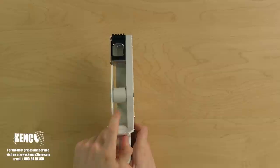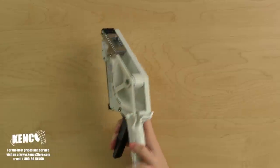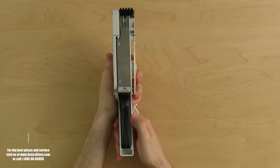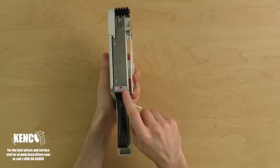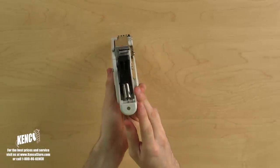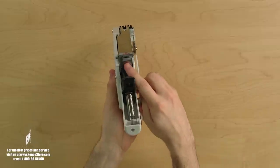On the label shaft, you will see a plastic core. I'll be talking more about this plastic core later on. Rotate the applicator and take a look at the bottom. Here, you will see the feed mechanism door and a hinged latch at the bottom. This latch has a set of teeth to help tear the liner and a lift that helps bend the liner away from the trigger.